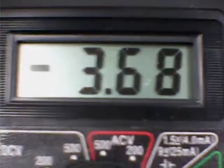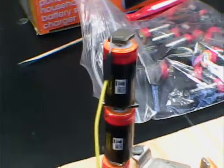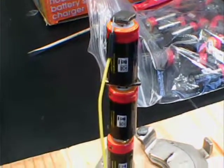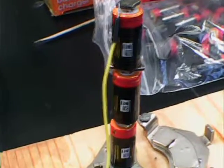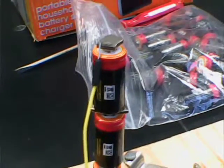I have them hooked up in series, of course, and you can see that right now I've got a voltage of 3.68 volts by stacking them. They're fully charged — just about 1.25 volts each. Let's check: 1.2 volts, so 3.6 — I'm over a hundred percent charged. Now I can use these to do work or to evaluate power output. I use Vernier boards and sensors with my students. I'm a chemistry professor in western Pennsylvania, and that way I've got a 3.68 output.